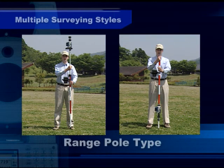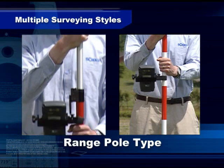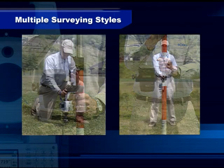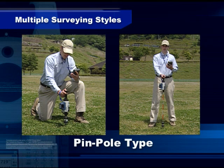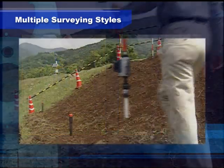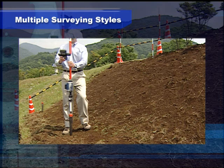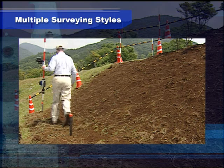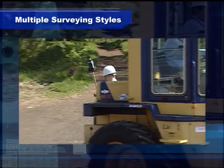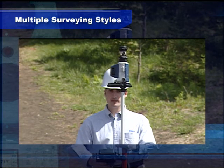The Sokkia Freestyle 360 concept has the flexibility to give you the freedom to choose the right style of prism pole for the job. You are free to select from range poles and Sokkia's industry-first stylish pin pole configurations. Both pole types can be used with a 360-degree prism, electronic field book, and on-demand remote control system. Using the range pole configuration, as-built surveys for highways or reclaimed land can be comfortably performed while standing. By attaching the prism and on-demand remote control unit to the top of the pole, you can efficiently survey while avoiding obstacles near the ground.